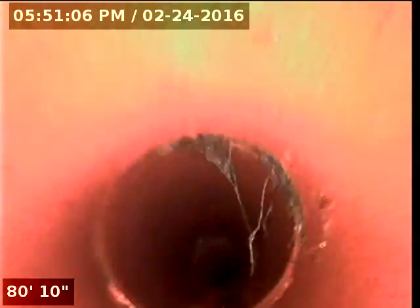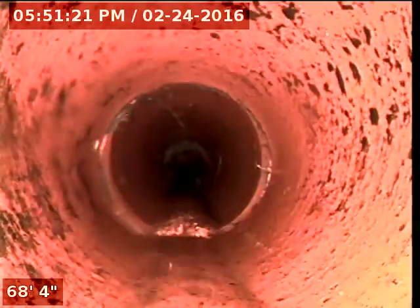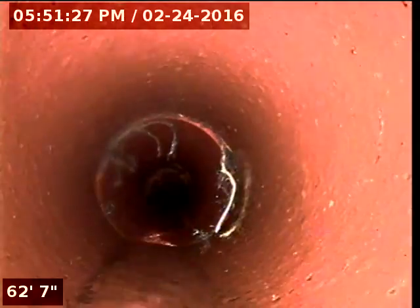It's real nice to get that other cleanout going. It's a little bit slow, but it's saving you an over-100-foot charge. You also need a better cleaning because the blade is closer to the 6-inch pipe — that way you don't get slowed down by the 4-inch pipe as much, and it'll do better. The stacks don't really like pulling that much cable back through them.